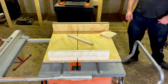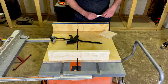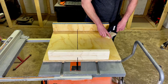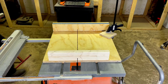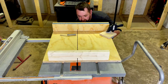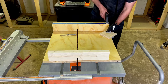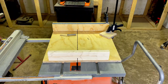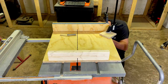I measured A and B with the calipers, then took A minus B and went through the whole formula — which is not that complicated, but I will leave a link to a video on that in the description below. That calculation tells me how much I need to adjust this side of the fence. I put a stop block there, and for this one I needed to adjust it up just ever so slightly — just a few thousandths of an inch. So I did that using a pair of feeler gauges.